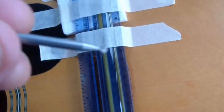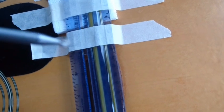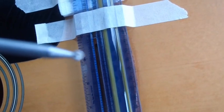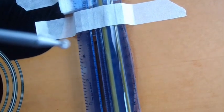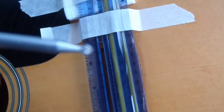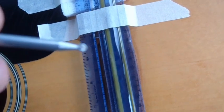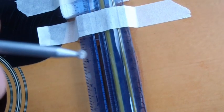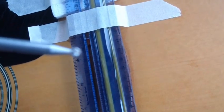The reason I'm going to use an electric power drill is this, because the fact is, if you use a Dremel on it, the Dremel starts at about 1500 RPM, whereas a power drill has lower speeds, and it's a variable speed power drill. And I'll use that, and I'll use a very slow speed, because they claim that rosewood is a very hard wood, and when you try to drill or work with hardwood like that, you've got to have a slower speed, or it's going to start burning up. So we're going to try that.